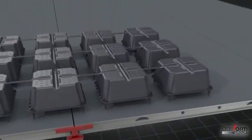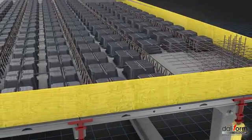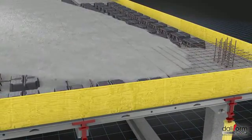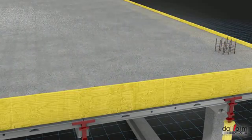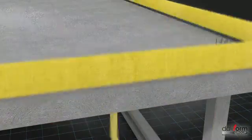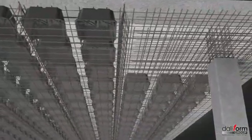The entire operation is precise, handy and rapid. Once the concrete is poured, the voided structure is permanently embedded, providing the structure with the desired shape. On the technical timing for the setting having lapsed, the decking will be dismantled. The intrados surface will prove to be completely smooth.